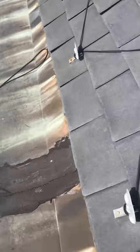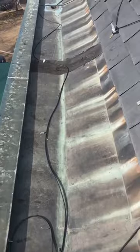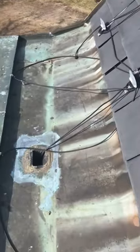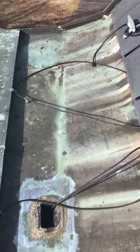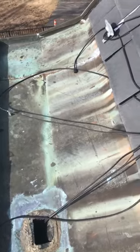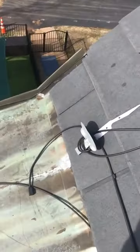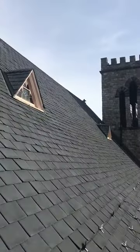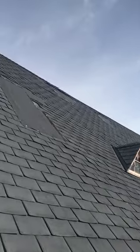Every joint down through here is just opened up severely. The best recommendation is to line this drain area with rubber so we have a nice surface for the water to drain off rather than penetrate through all the joints. That's where all the joints were probably soldered — they cracked apart and were just tarred up. Those are the issues we have. We'll take some measurements here and check out all the other gutters.